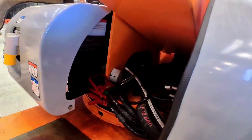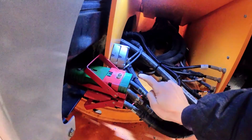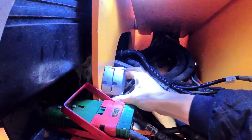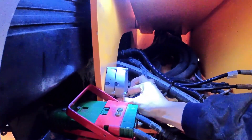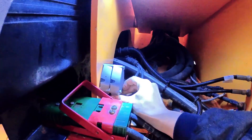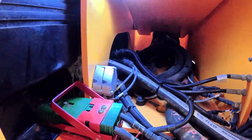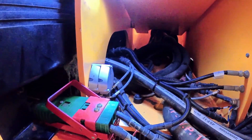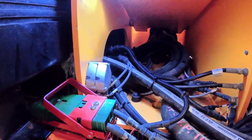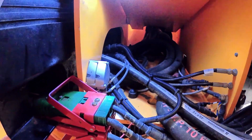I've gone up on the links to get access to the sensors. So these are my two sensors that I'm reading the voltage from. What I will do is swap the cables over just to see if that makes any difference. By swapping the cables, I'm expecting sensor number 1 to go into fault and sensor number 2 to start behaving as it should. I'll swap those cables over and try to drive again from the cage to see the voltage.